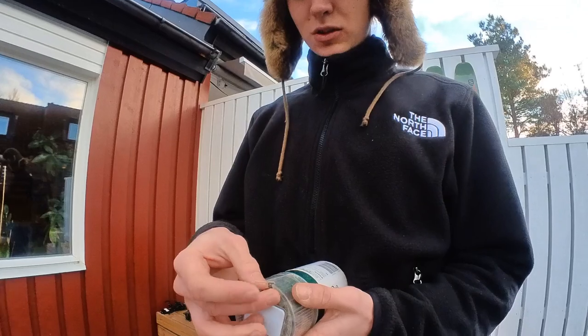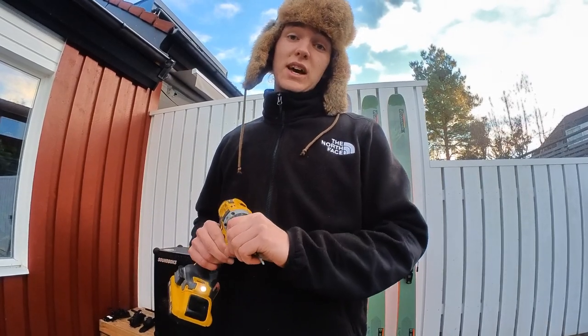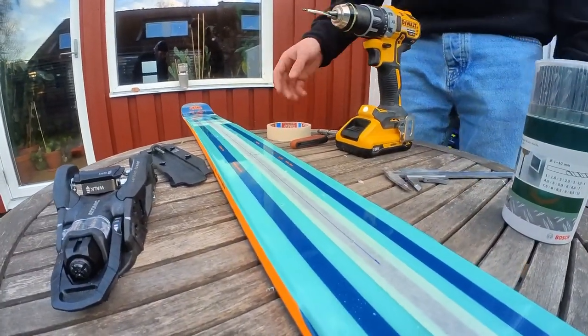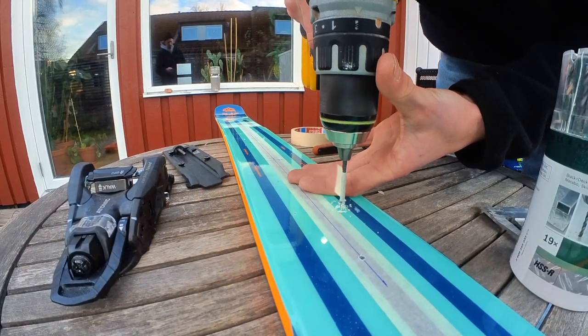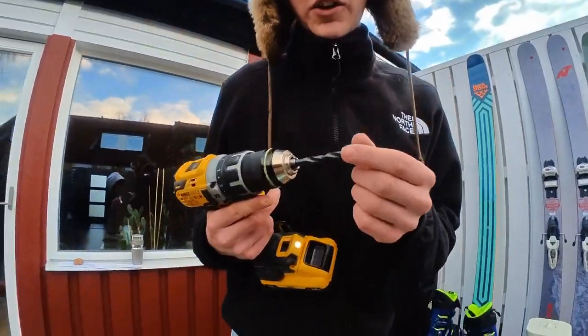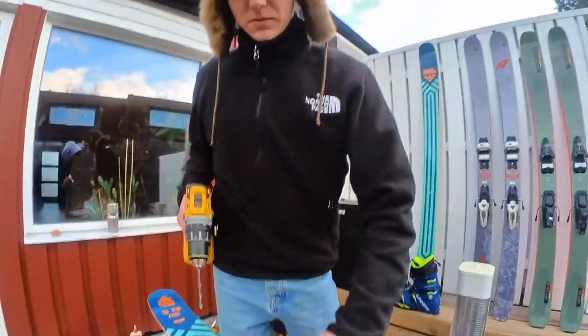This is a step I really recommend because the holes from the center punch are quite small and we need the exact locations for the bigger holes later. I'm putting back the 2 millimeter drill bit and switching to a 3.5 millimeter drill bit for the bigger holes. I'm going to mark the depth stop with a piece of tape at seven millimeters as we measured with the calipers. You really want to have the tape on to prevent you from drilling all the way through and coming out on the underside — that would be expensive. I also use a larger drill bit just to countersink the holes and get rid of the burr on top to get a good connection between the end plate and the ski.